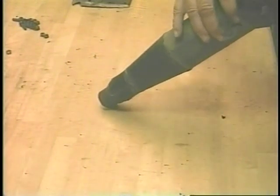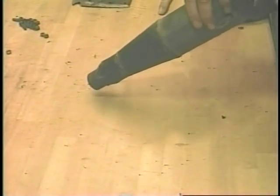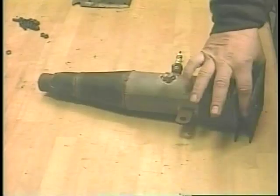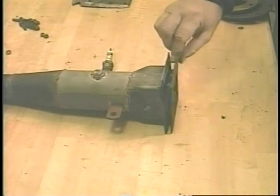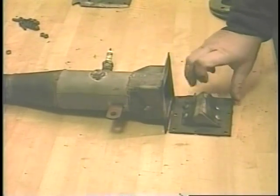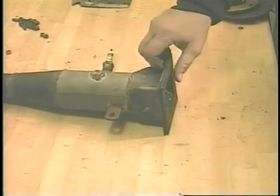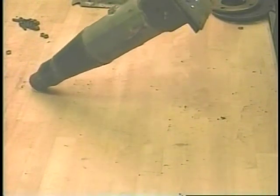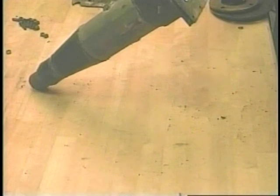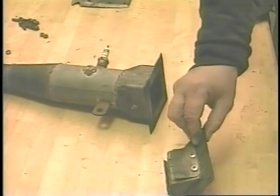Now, this one here was invented by accident. The explosive resonator was invented by accident. It was first made to double check the valve assembly setup. This was originally supposed to be a full-length 3-inch motor, but it ended up becoming an explosive resonator at about 14 inches. It normally would have been about 30 inches. The valves were not a success.